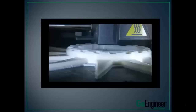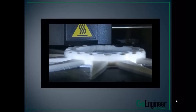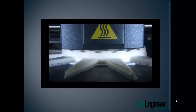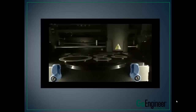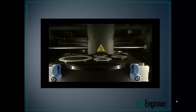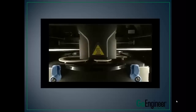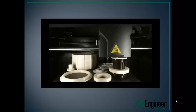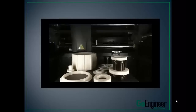We're going to watch a video of the FDM capabilities. This is one-to-one speed — that's about how fast it lays down the material. The white tip is the extrusion head; material gets fed through that tip and laid down on the surface of the model. Here's one sped up. The brown shiny material underneath the white material is the actual support material — that gets washed away in a solvent bath or cracked off, depending on the material. You can see different-sized parts on a platen, or what we call a build — this is actually a wheel assembly built all on one platen.